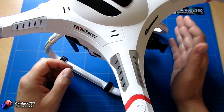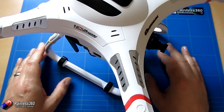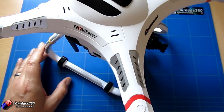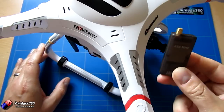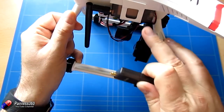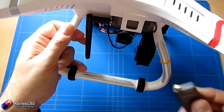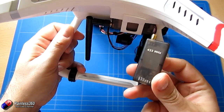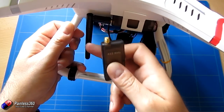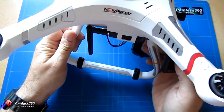The way it works is rather than have a USB cable connecting your computer to the model, what you have are two additional radios - one on the ground that is connected into whatever it is you're using, usually a PC or something else, and then one connected here on the side of the model usually with the aerial pointing directly down and the one on the ground station with the aerial connected directly up. This is essentially like a wireless USB cable that connects over that link.